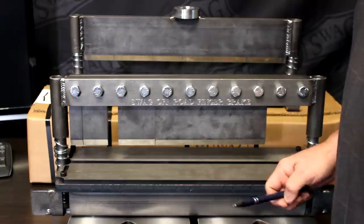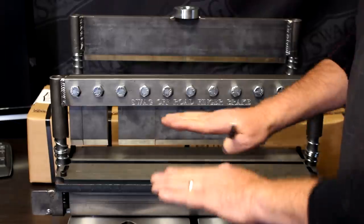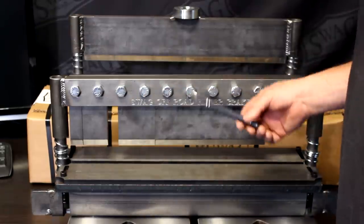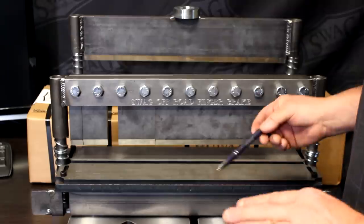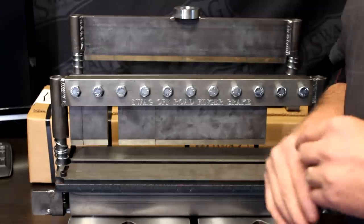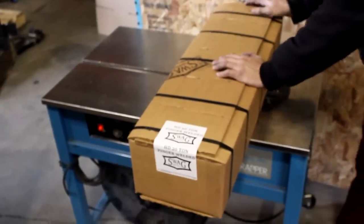Finally, the flat top is a five-eighths inch thick steel plate with two sliding three-eighths plates on top. Loosen the four Allen bolts to adjust those plates, slam them together, and you can bend a penny in half with this thing. We also include an extra half-spring for each side for the extra clearance the flat top needs, as it sits directly on top of the press brake. It self-centers on the brake, making it easy to install. If tight radius bending is your game, the flat top is the ticket. All of our 20-ton brakes come in a DIY builder kit or a fully welded version ready to go out of the box.